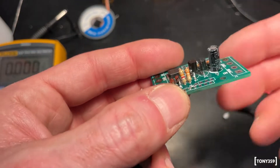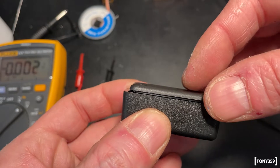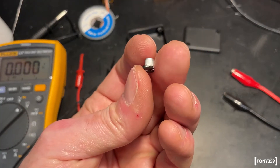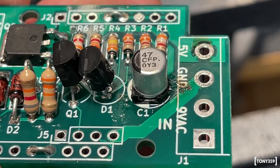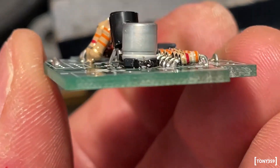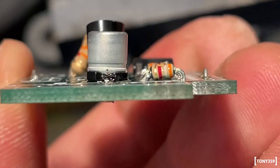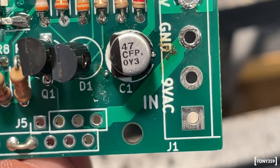As I totally suspected, this capacitor is a little bit too tall — it sticks out and I cannot close the nice little box. I happen to have an SMD version, so I'll try to adapt that instead. I'm afraid I couldn't capture this on camera, but it's not 100% straight. It's not touching the PCB though, and it's not exploding.